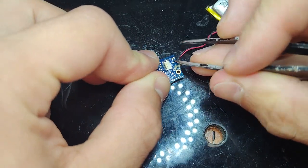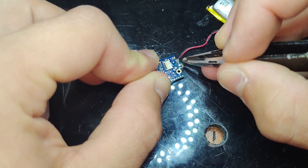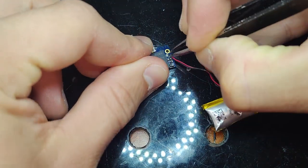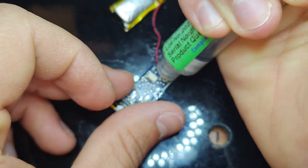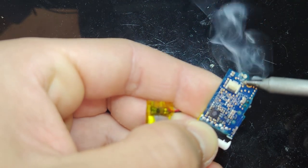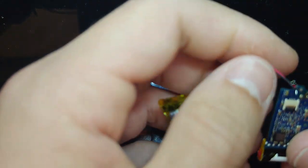Now coming over to the soldering iron. Before we actually remove the battery, there's a bit of rubber adhesive or a rubber coating that's just over the solder joints there, so we want to get that off with some tweezers first. It comes off pretty easy. Just apply some flux and then heat that up with the soldering iron. I like to pull the cable slightly as I'm soldering so it just falls out, but don't pull too hard because you can rip traces off the PCB. So just be gentle.